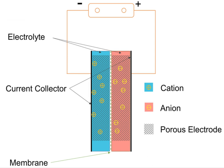The separation of charge is of the order of a few angstroms (0.3 to 0.8 nanometers), much smaller than in a conventional capacitor. Electrochemical pseudocapacitors use metal oxide or conducting polymer electrodes with a high amount of electrochemical pseudocapacitance additional to the double-layer capacitance. Pseudocapacitance is achieved by Faradaic electron charge transfer with redox reactions, intercalation or electrosorption.